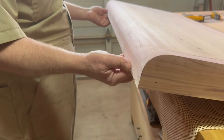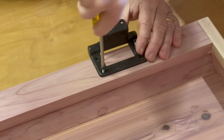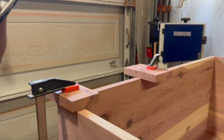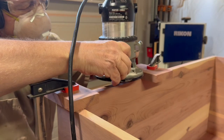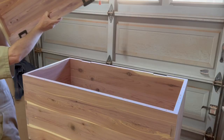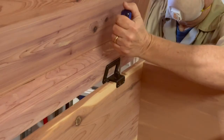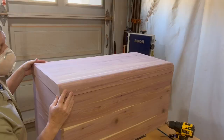I'm going to fit the hinges before attaching the trim around the lid. For the lid to sit firmly flat, I need to cut mortises for the hinges on the back panel using stop blocks and a straight router bit set to a depth of one-eighth inch. These hinges are awesome — they have enough torsion strength to hold the weight of the lid open even if it's only partially open, preventing it from crashing down. With these hinges you don't need a separate bracket, chain, or hydraulic cylinder like you'd see with piano hinges. For any chest like this, I highly recommend them and I'll leave a link in the description.